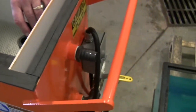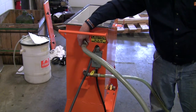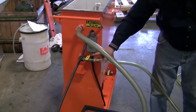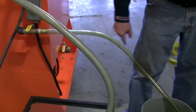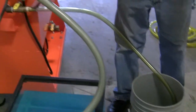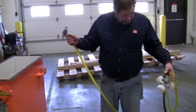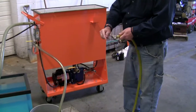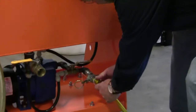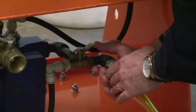Next we're going to hook up the hoses. Here we've hooked up the discharge hose — it's easy to tell, it's the biggest one, one inch diameter, and it goes on this port here. This elbow ball valve fitting is where the tramp oil will come out of the tank and be discharged into a bucket or wherever you want it to go. Now the next thing is to hook up your skimmer or your suction device, whichever one you're going to use. They both come equipped with cam-lock style quick disconnect fittings, so it's very easy to change from one to the other.